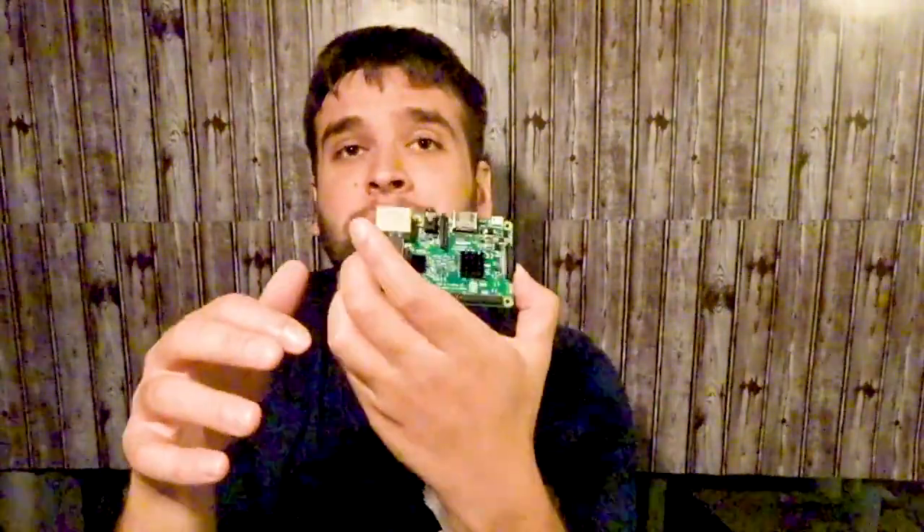The main limitation of this buck converter is the output amperage it produces — it is 3 amps. A Raspberry Pi does run on 5 volts at 2.5 amps, but what I have found is the LM2596 really doesn't produce that full 3 amps. When I hook this thing up to a Raspberry Pi, it is really struggling to get the energy it needs to actually work precisely, consistently, and reliably.